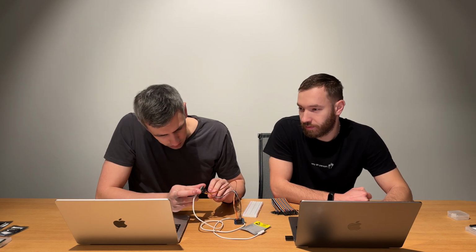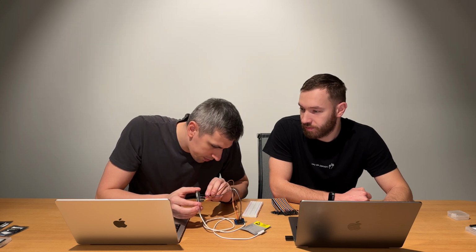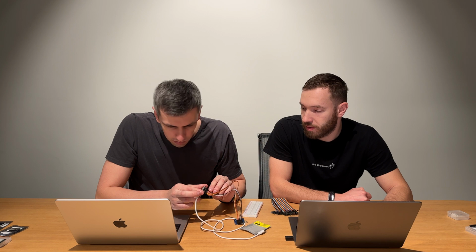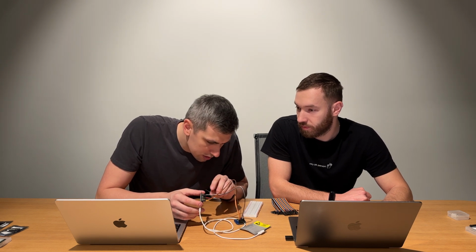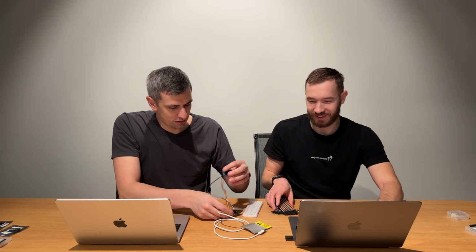So the next one, RES, actually goes to the D4 pin. Then we have DC, the white one, which goes to D3 on the board. Then we have CS, which goes to D1. Skip one. And we have BLK, which goes to D6, between these. And now we can hope that we did it correctly, and we will see something.